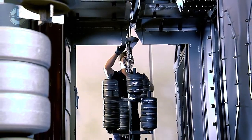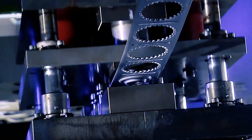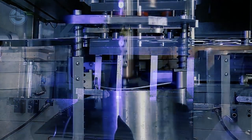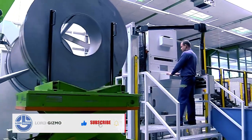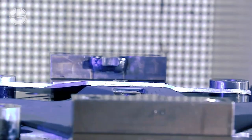In this clip, you will see how different types of casters are manufactured in Blickle's factory. Casters are similar to simple wheels, but metallic parts are attached to them. This metal part is called a fork. It is made by cutting a thick plate of steel in the form of a circle. A pressing machine then molds it into a fork shape, after which holes are made with the help of a press cutter, so that it can be attached to the equipment with nuts and bolts.